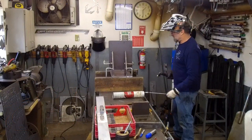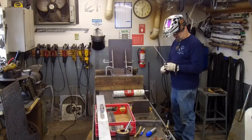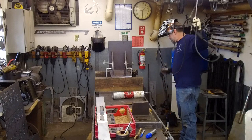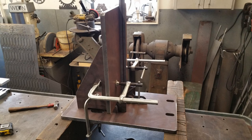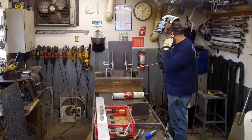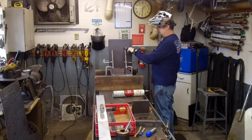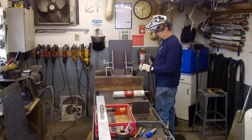Okay, I'm ready. I'm going to buzz some weld on this. I've got the table cleared of all my scales and measuring instruments. Okay, there we go. Stinger's all set, ready to go. Here's a couple of pictures looking at different angles around the setup, because I want to keep the camera away from this area. We only have the front and back of the lower sections, and the top and bottom around those bosses. Those are the only areas we're going to weld.